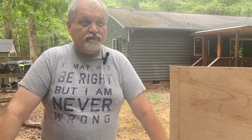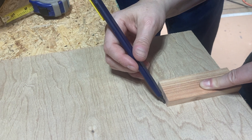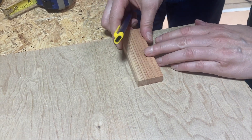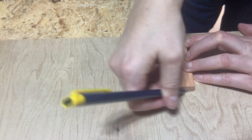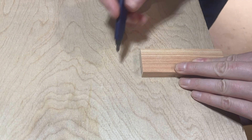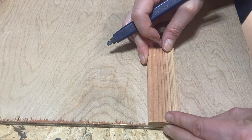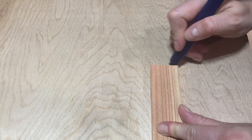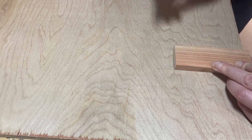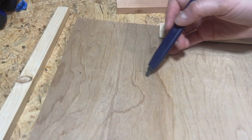Next we have a lot of cuts to do on the two-by-fours. We cut a piece of wood as a storyboard at four inches because we want the frame to be four inches wide. We use it to mark all four corners. Using a storyboard instead of measuring ensures a perfect layout. Stop measuring, throw that tape measure away, and start using storyboards — it gives you a much more consistent result.